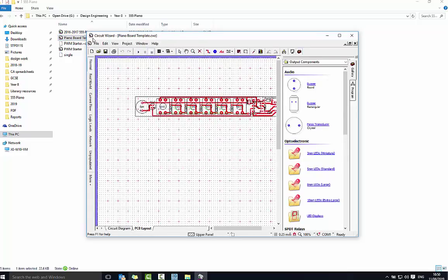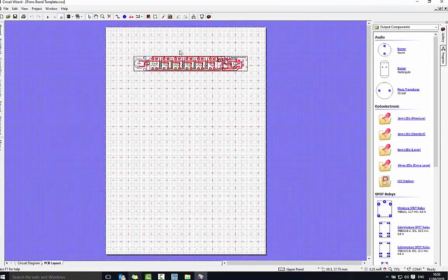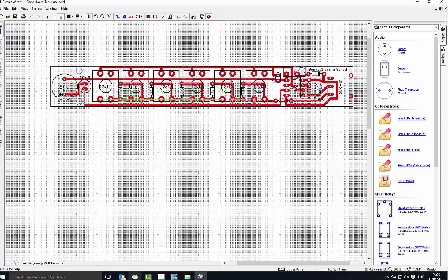It does something a little bit weird but it should give us an idea. As I zoom in you can see these blue circles — they're all 3mm. These are going to be our mounting holes. The idea is we're going to make a board that fits onto there with about 3mm all the way around the outside, and we're going to put holes here, here, and here so it can actually be bolted onto that board. We'll also put a really large hole in here so the battery snap can fit out the back. We're ignoring this other one because that's where the battery leads come out.